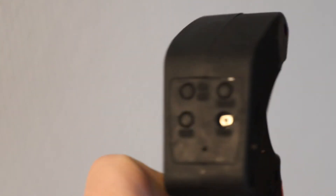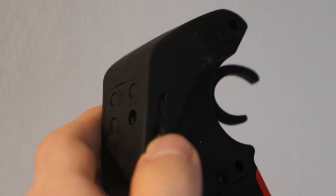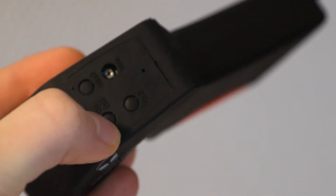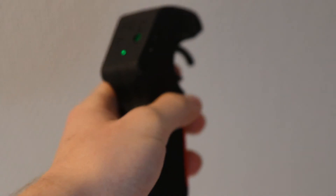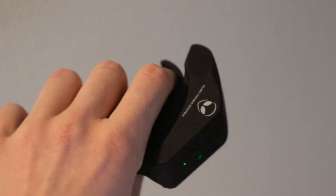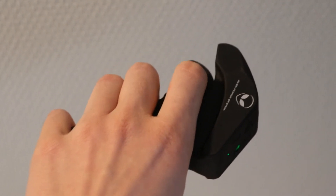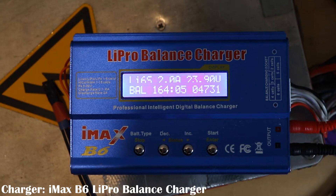The new controller is very small, light, and rechargeable — the battery life lasts literally weeks and I barely have to think about recharging it. The downside is the throttle, because it's very very sensitive, making it difficult for first-time riders to learn on this board. This problem can be avoided by upgrading to an ESC that allows programmable throttle curves; mine does not have this capability, so I had to become very precise with the throttle. It definitely takes a couple of weeks to get fully comfortable, but other than that this is the remote I recommend.